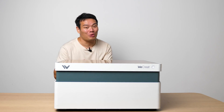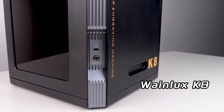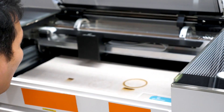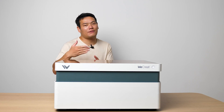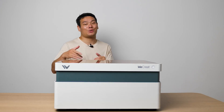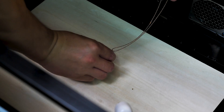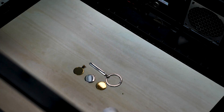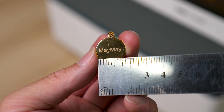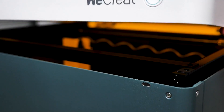In the center, the error was minimal — only 0.5mm to 1mm. So are these results normal? I believe they are perfectly normal. You might wonder why there can't be zero error. Based on my experience with similar machines like the xTool and even the more expensive Glowforge Pro, no laser engravers can achieve zero error at the moment. An average range of 0.5mm to 1.5mm is definitely top-tier in the industry — one of the best I've ever seen. The key takeaway is that with laser machines like this, achieving the best accuracy involves placing materials in the center. For larger engravings with less stringent positioning requirements, you basically don't need to worry at all.